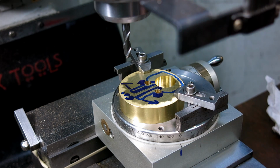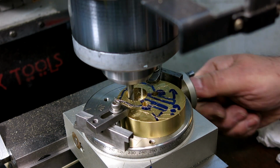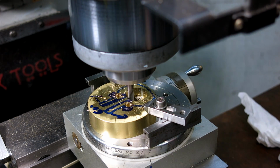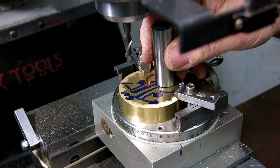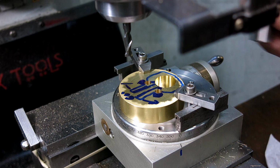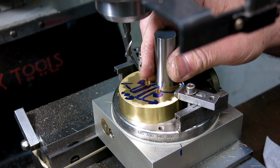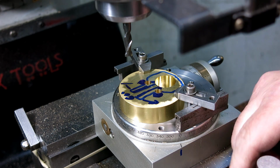All right, sneaking up on it. That's a 740. It's probably not going to go. Yeah, it's a 739. So first rule of walking to go get pins is grab more than one. The one that you want to fit and the one that will probably fit. All right, so that's 739 right now. Our target is 742 diameter, so we're right there. All right, a little bit more.